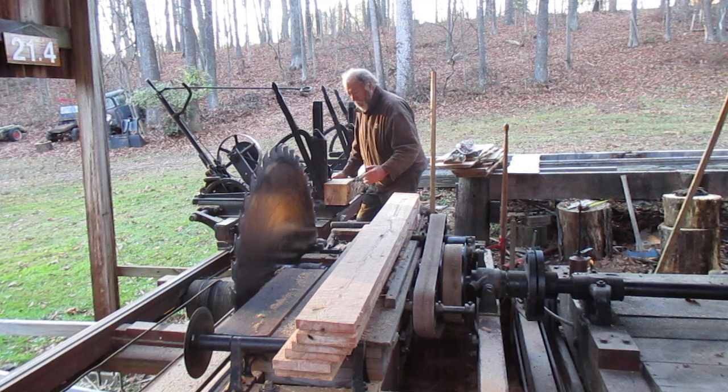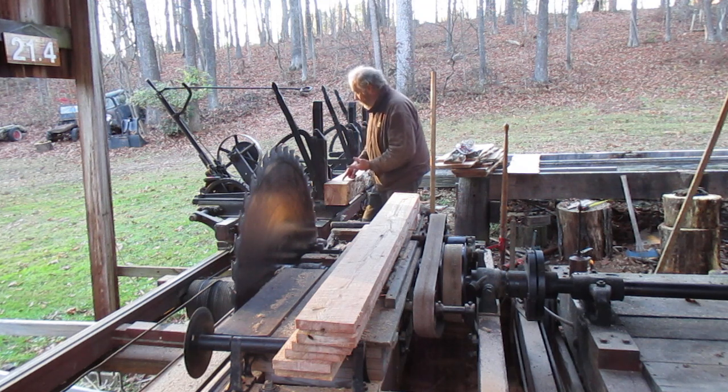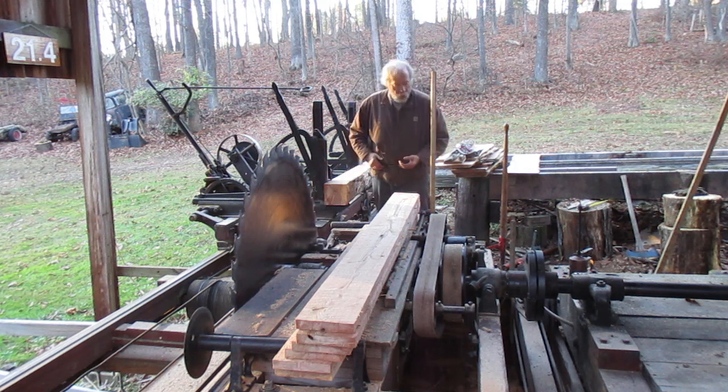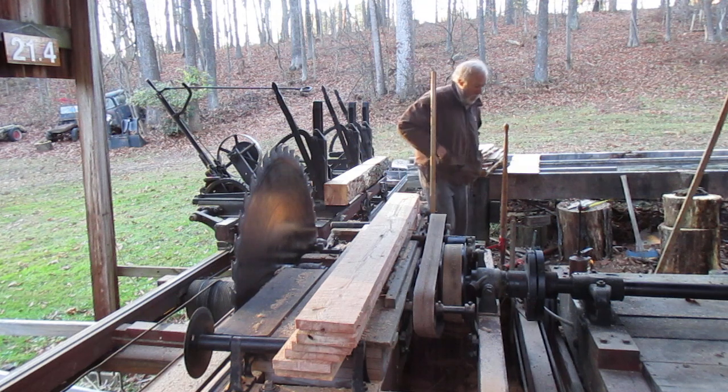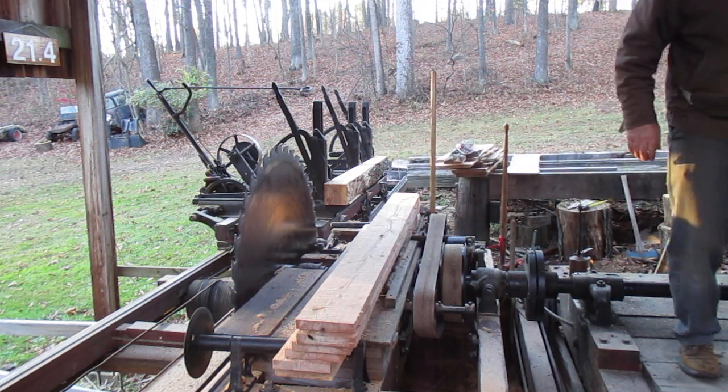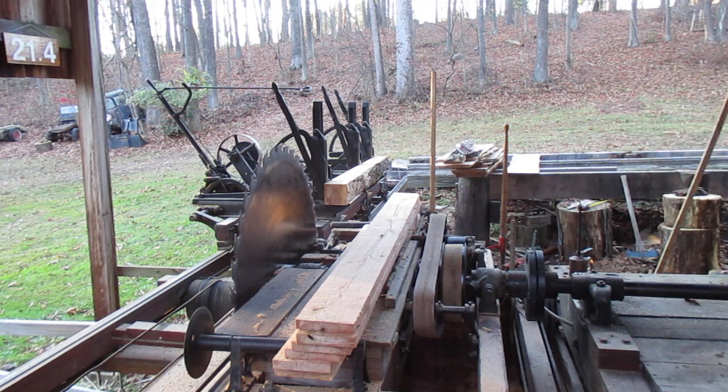And the same thing with this one. I sawed it down. I know that I'm going to have to go 1 inch, 2 1/4, 3 1/2. So I want to come out here. My first set's going to be at about 3 1/2 to do my first cut, and then I'll get three boards out of it and have a little waste. Anyhow, that's it. I got to do more cleanup again. Just the way it is. Over and out on this one.